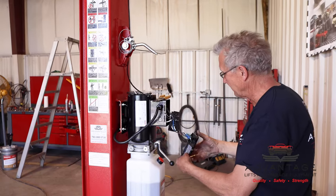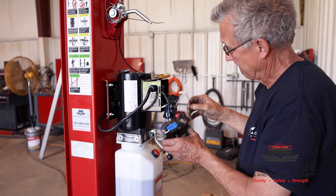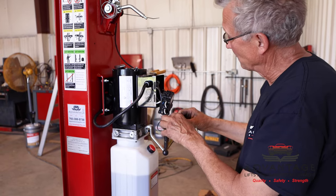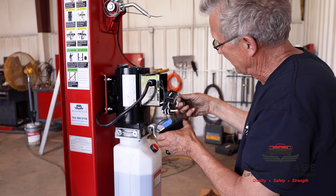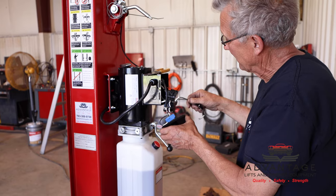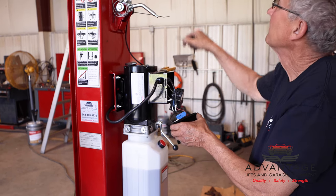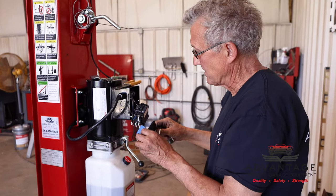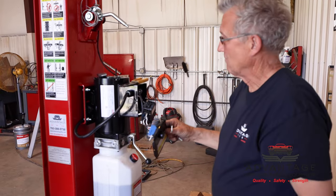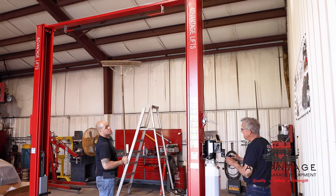Now what I did inside the control box, I basically removed this wire right here. The one wire from the switch that went up and pigtailed into this other wire at the top of the contactor. Basically this wire jumped from there to there. I removed it, so now when the power, this is one of your power legs, is turned on, that power has to go up through the blue wire, through the switch, down to the red wire, to the push button. So when you push it, now it lets power through to the coil, which then closes the contactor and allows the lift to run. So let's go turn the breaker back on and make sure it all works. Okay, again, you push the button, we got power, it should run.